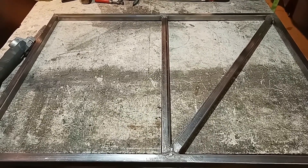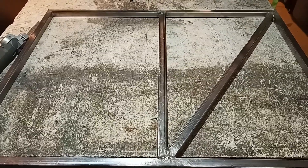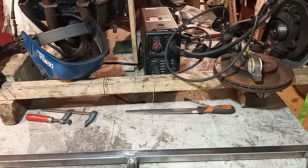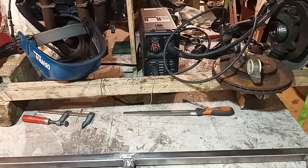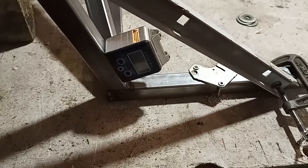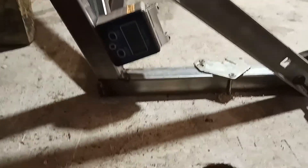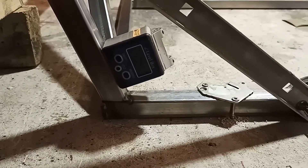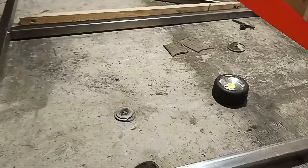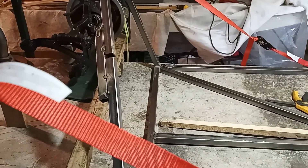There's the floor of the passenger area done on the frame. The engine sits to the left of this picture. I'm now going to go vertical and put on the back and sides. I'm still getting used to this little Viper 120 welder, which is synergistic, so I'm trying to find a setting that gives me flat welds without being so hot they burn up the metal. I can't trust the build table to be flat, so I'm setting this up the old-fashioned way with lots of measuring, using a digital inclinometer and spirit level to make sure all of my setup is level. I then clamp and put in tack welding and braces to hold it at the correct angle while I get on with the more extreme work.